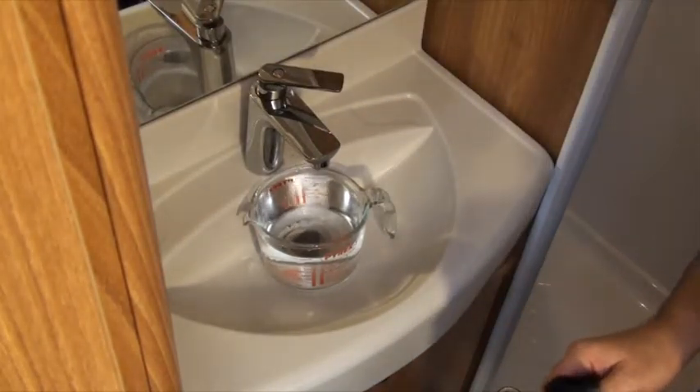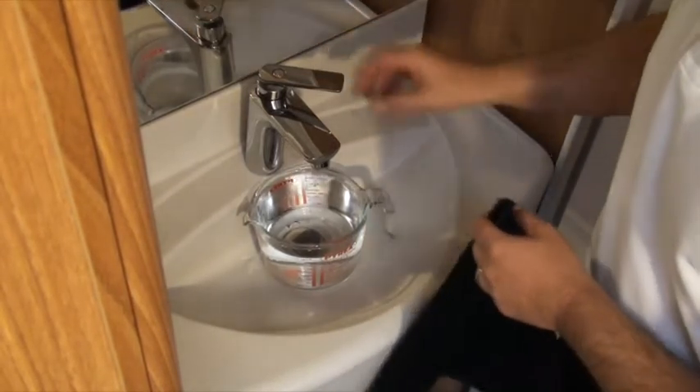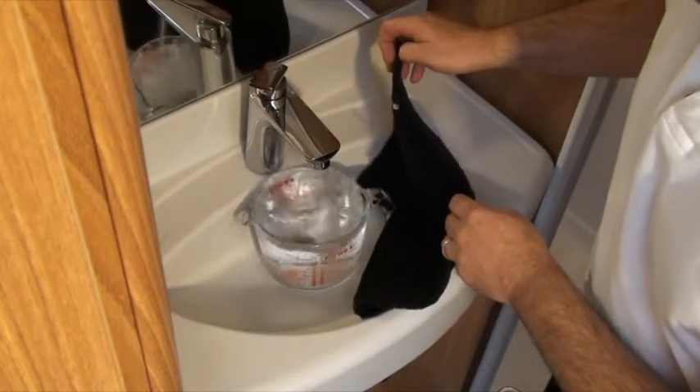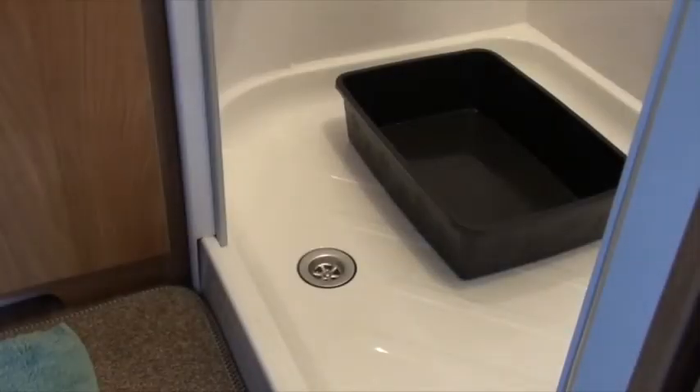Flow has built up in pressure again, so we'll open the hot side. The jug is starting to overflow so I'll just pour it into the basin. When it comes to draining the toilet, very simply — just like you would open and close any other outlet — you just press and hold this button. You will hear a distinct difference between the water coming out into the toilet and then the air following behind. When you hear the air coming, you know there's no more water in the mechanism and it is then frost protected.